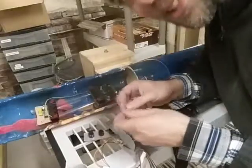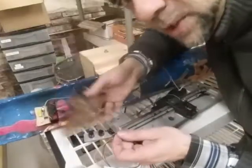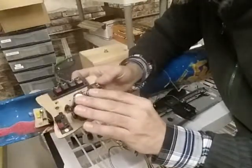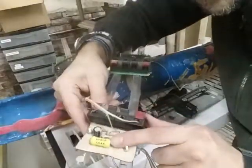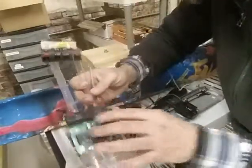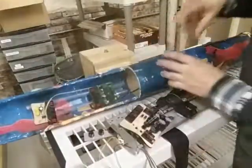This instrument, although it's digital — you can use digital signal processing, customize it, make synthesizer sounds, effects, everything — and you do not need to plug it into batteries or recharge it. The electrical power from back-driving the stepper motor gets rectified and doubled, then turned into DC. That DC drives a voltage regulator, the regulator drives the CPU, the CPU generates the signal to the amplifier, and the amplifier drives the speaker on the instrument.